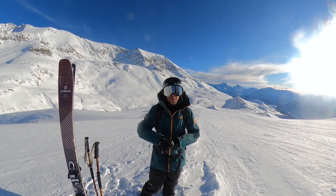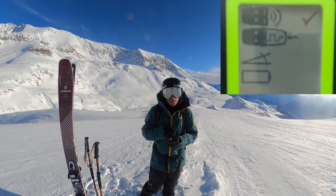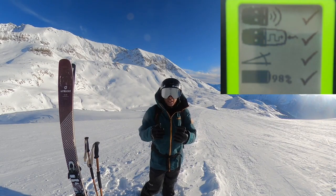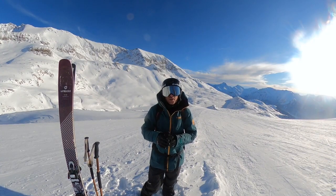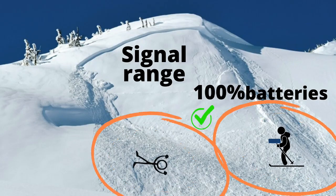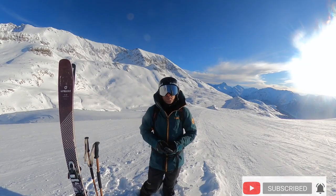Check number one is your battery. As soon as you turn your transceiver on it's going to give you a battery readout. Make sure your battery is always over 80%. It's not that during the day you're going to use 80% of your battery — it could actually last a long time. However, when the battery starts to drop, the range it can send and receive a signal starts to drop as well. You want maximum possible signal. 80% or less, change the batteries. It only costs a couple of euros for a fresh set and it can save your life or the life of your buddies.